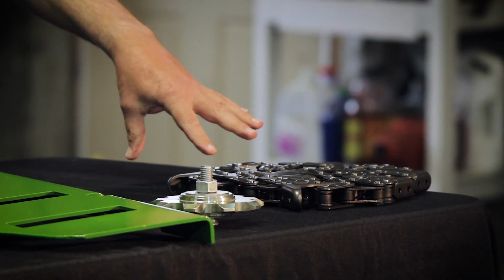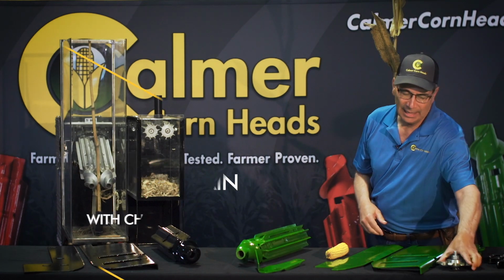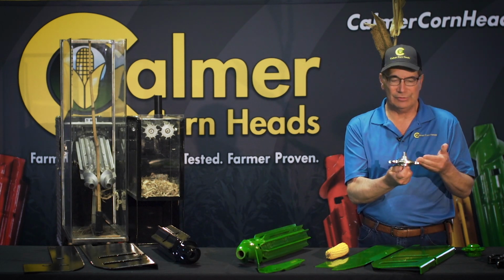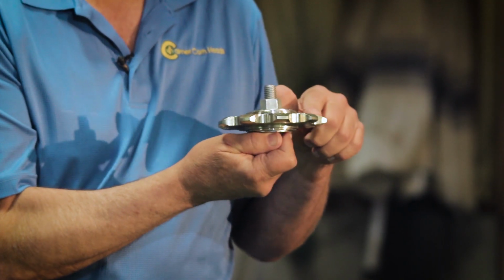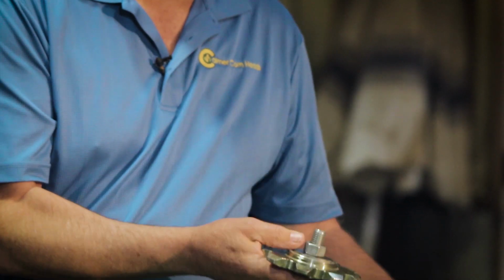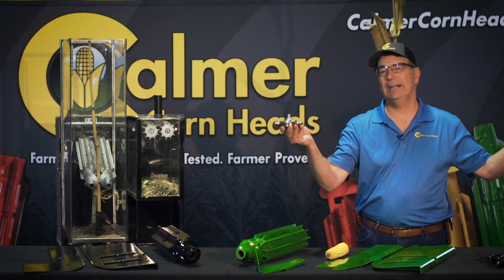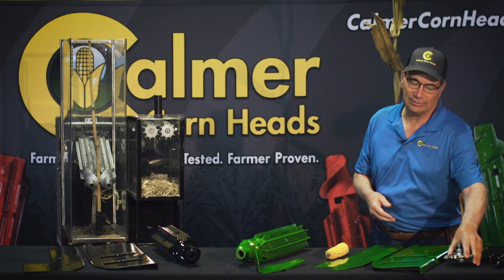Ours happens to have chrome pins in it so that we can extend the life. As I rebuild corn heads, I prefer to just rebuild it as nicely as I can so that I don't have to come back and do it. So we're using a high quality chrome pin chain. And we've also switched over to a higher quality idler sprocket. It's solid, it's got a sealed bearing in it, but the unique thing is this has 9 teeth instead of 8. So now the chain envelope, smaller at the top, larger at the bottom, is still the same as what it's always been. So we're still running the standard gathering chain out there.